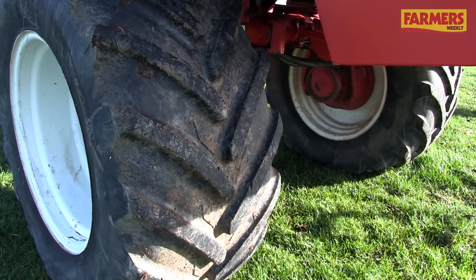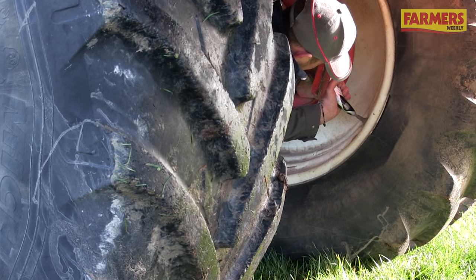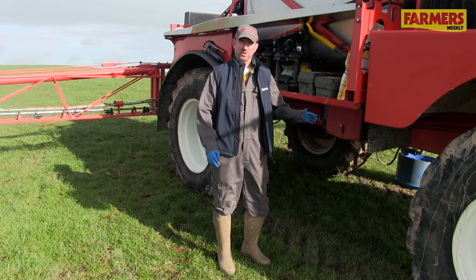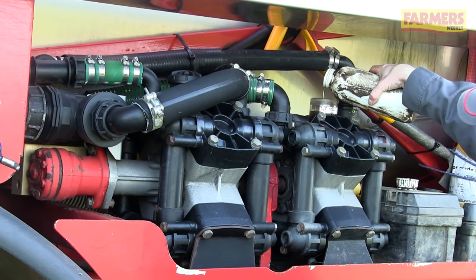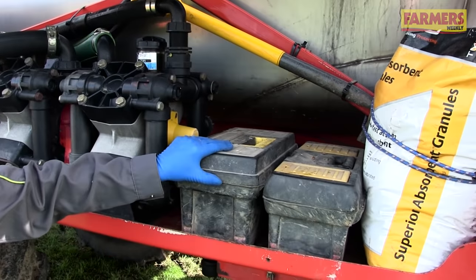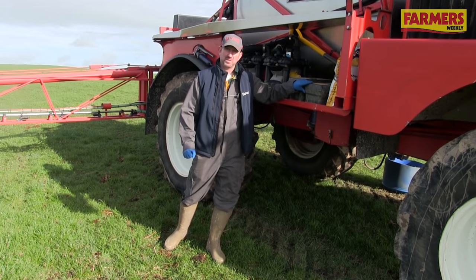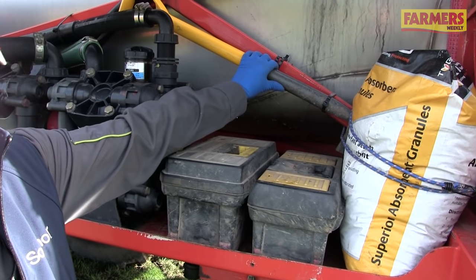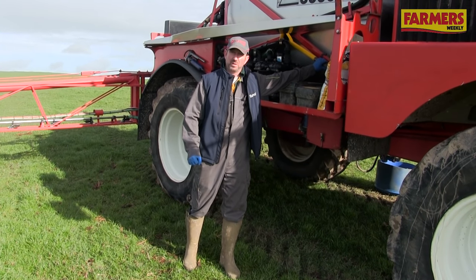Then we'll move on to the tyres. Check with the manufacturer of each tyre — they want to be run at the lowest pressure possible. I like to work around the machine in a nice methodical manner, starting at the front and working around in a clockwise manner. Coming to the pumps, checking the pumps, I've got oil in the top. Then I've got my toolbox with spares in here: diaphragms, air pipes, any connectors that we might need. And then a spill kit with absorbent granules and a spade so that we can make a bund or block any drains if worst case scenario happened and we had a spill.